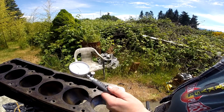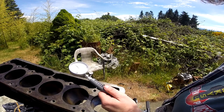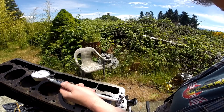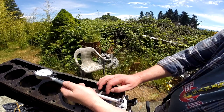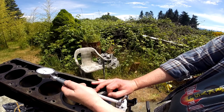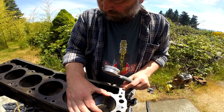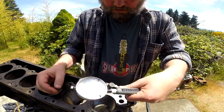As has been the case trying to get measurements that are in some way accurate, I think the digital calipers I have are not necessarily giving me what I need. With this gauge you really need to know what the base dimension is, or you have no way to interpret the under or over. Right now I'm going with about 22 thousandths over 3.4 inches. I'll look up whether that's realistic for a 50-year-old engine — 20 thousandths is usually what you'd overbore a cylinder to get it back round. Not sure I'll ever need to do that with this engine, unless I get some really screwy numbers once I get a better handle on this.